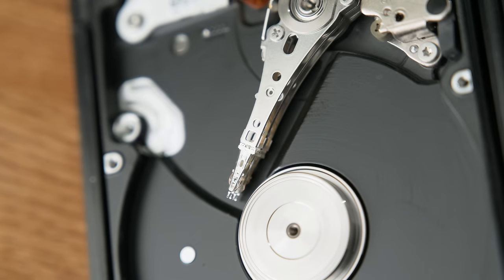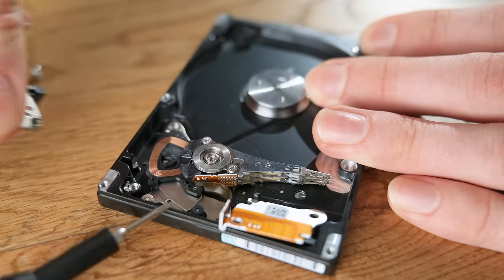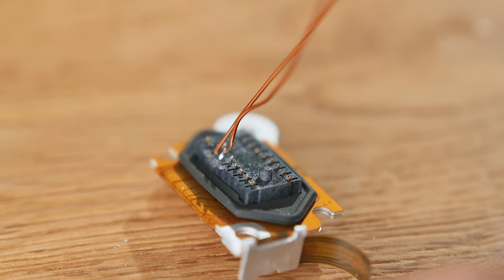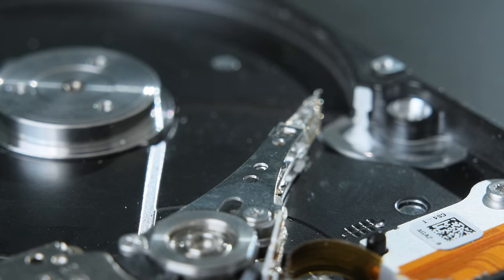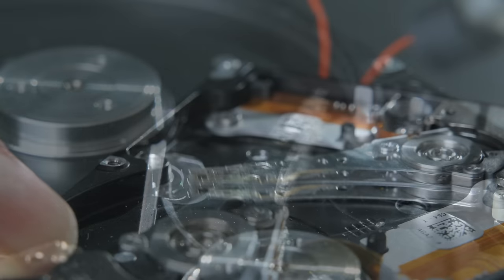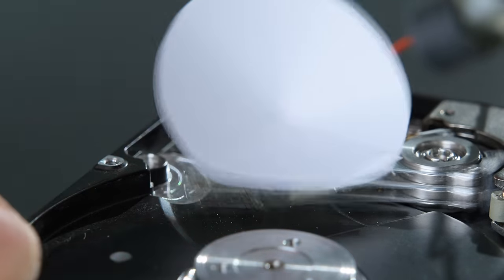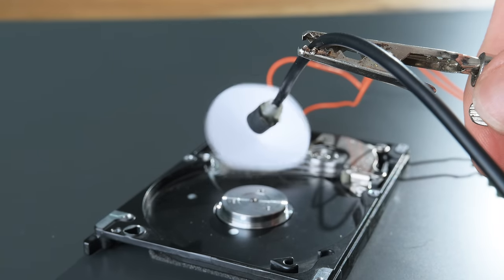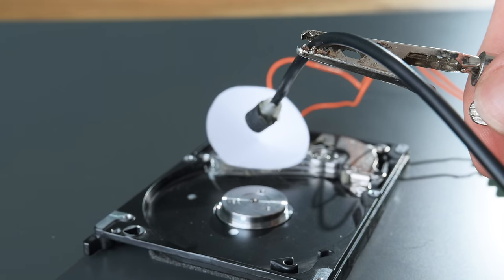Now, going back to the drive, there remains the head array. Its movement is derived from some coils underneath these powerful magnets, so if you solder some wires to these coils, the head can be forced back and forth by applying a voltage. If we rig up an audio amplifier to this, it will actually vibrate along with the sound signal just like a speaker. If you're wondering, it is audible, but it sounds very tinny. Adding a little paper cone improves matters, but while it's bass heavy up close, it quickly drops off and sounds tinny again further away. This isn't our goal though, as we've already made a speaker anyway, and the actual plan is much cooler.